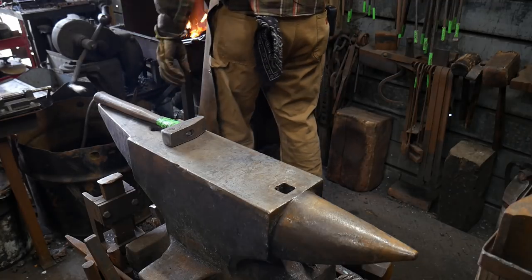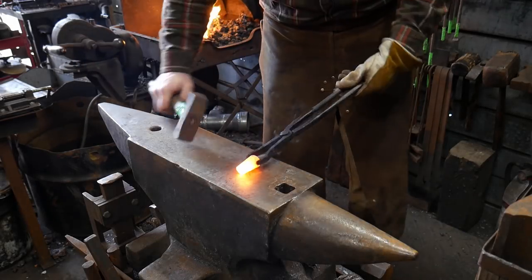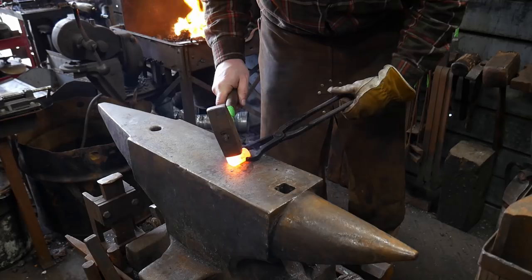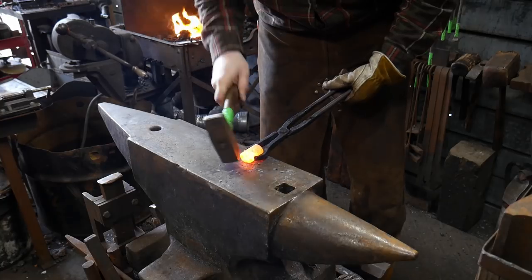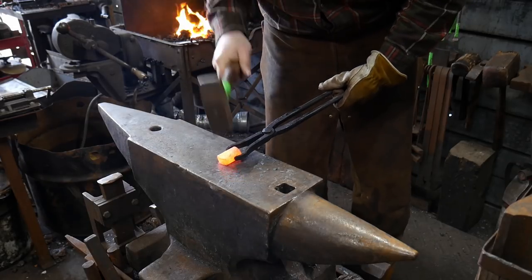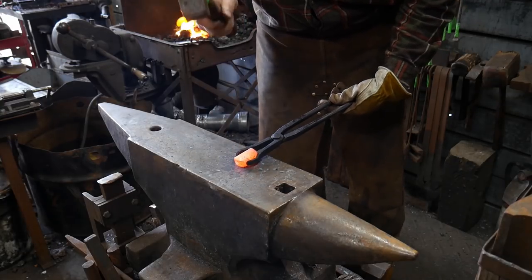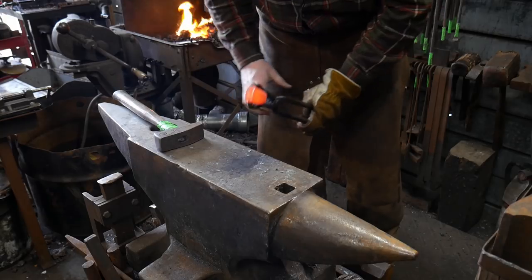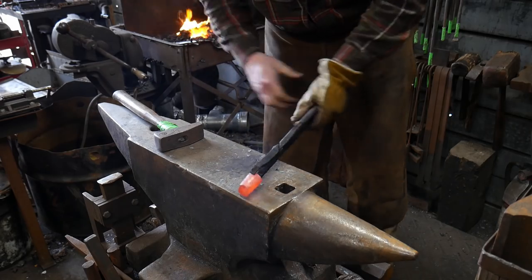I hope you all enjoy this video and we will continue here in just one second. So I've got this piece pulled out all nice and hot again. I don't want to hit it hard enough that the center mass of the bar moves — I just want to hit it fairly lightly to propagate that fish-lipping action. That's working good just like so. Cleaning up the facets, and that'll be good. I'll be filing and grinding this profile later on in this video.